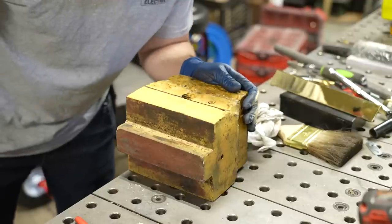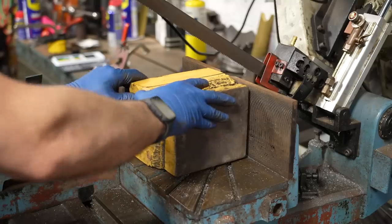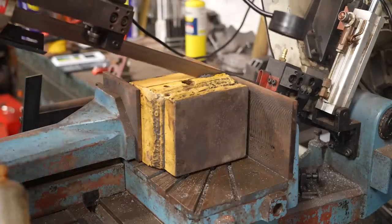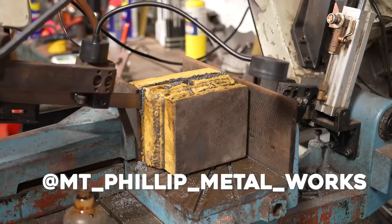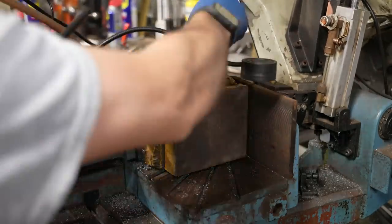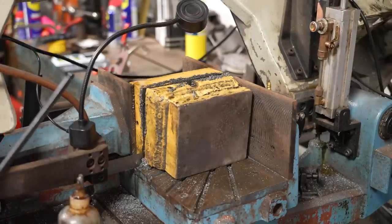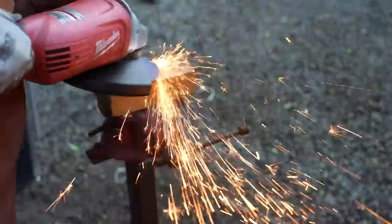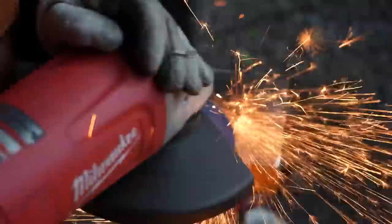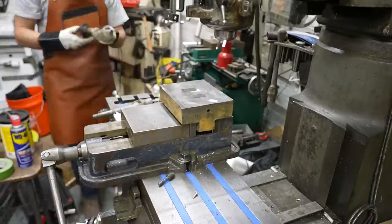These actually aren't that hard — I just cut this with a band saw. I tried cutting the bottom die with the band saw just to see how hard it was, and while it definitely had some hardness above mild steel, it was worth giving it a try. I called my friend Chris Cash over at Mount Phillip Metalworks for guidance, and he basically agreed with my theory of cutting down the bottom die, grinding it back flat, and going from there. There was really no saving the die as it was. After cutting it on the band saw, the original quick-change die hole was still in there, so instead of cutting it again — which would have been the right move — I attacked it with an angle grinder and a Victo grain grinding disc, which worked pretty well but was taking a little too long.